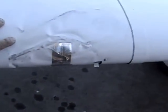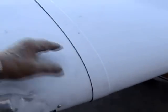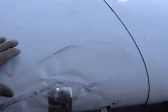To repair this now, we'll take this strap off. And we're okay back to here, so we'll cut right across here out to this rib, leaving just a little skin on the inside, and then cut around it and go back on the bottom about that much. Try to stay forward of the inspection panel under there and see how much of that skin's going to come out, and then delaminate from around here, peel that skin off, and we'll cut this section out of another wing